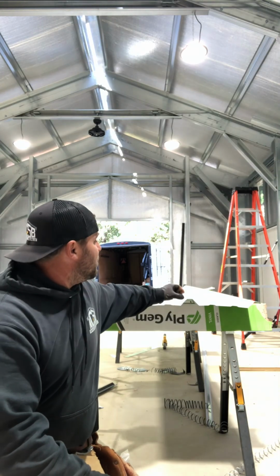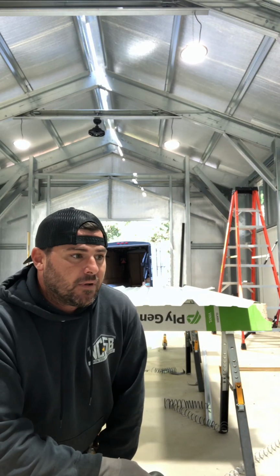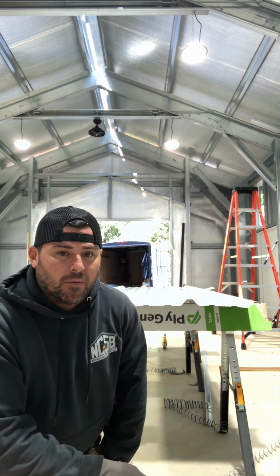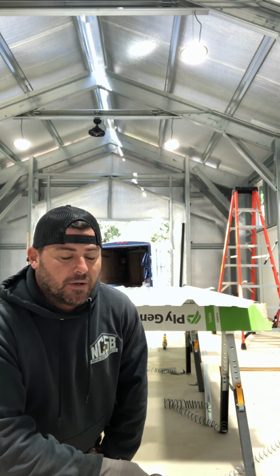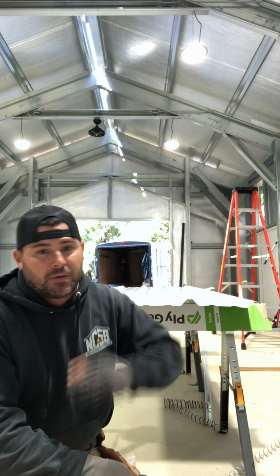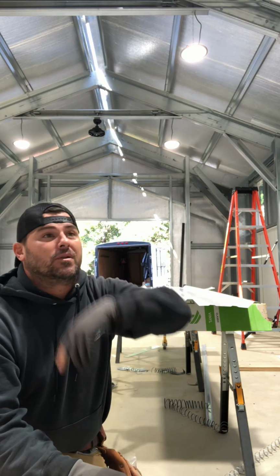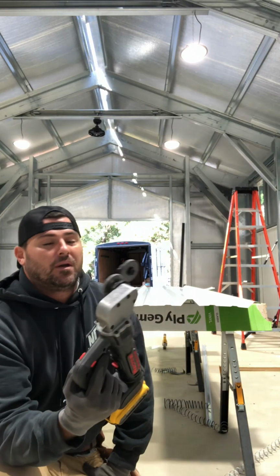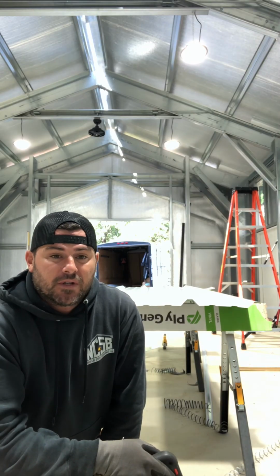I just have to take about a half inch off the top of this panel just so it gets enough clearance when I'm putting it under this eave overhang we're doing. Later on I'll do an angled cut for an end wall where we're skewing for the pitch, and I've used it on that for all these panels on the back of this building we're doing. And I love it for that because, for one, just reducing those nibbler shavings.